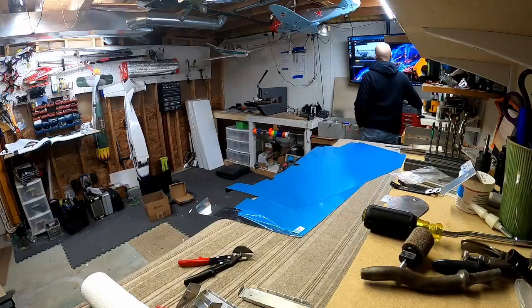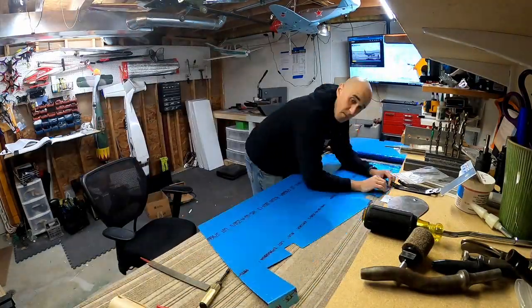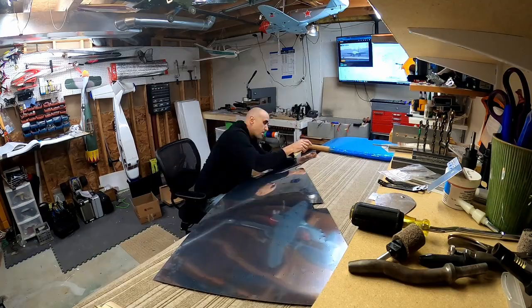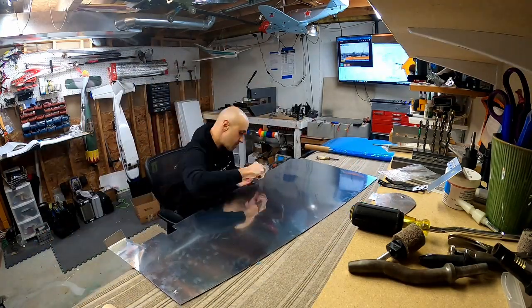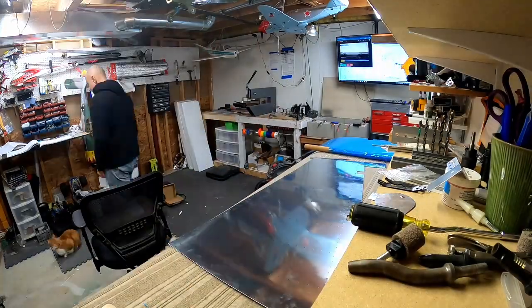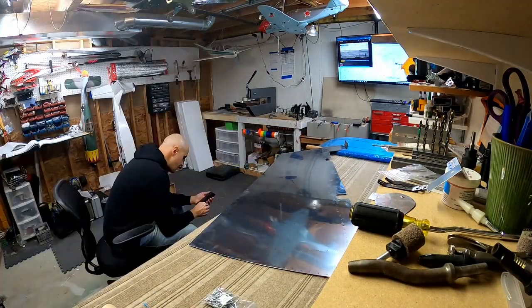And I think this is on to the next day. I'm going to take the blue stuff off the skins and then do the edge deburring on all of those. This is just an edge deburring file — first run the file over it. Most of the time you can sort of feel where the burr is. You might not have to do as much work on one side as the other side.